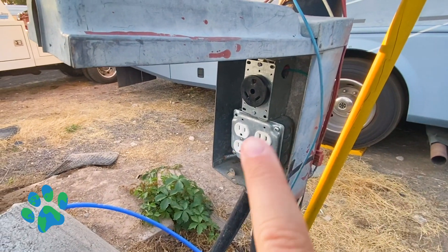After we alerted them to the outlet problem, when they opened it up, what they found was actually not reverse polarity — which is interesting because that's what our surge protector was reading. It was actually that the hot wire had been cut with too much slack, so it was all coiled up inside the electrical receptacle. The outside casing is metal, and while the wire is insulated, being coiled up against it caused the insulation to melt away until it completely melted and electrified everything around it.